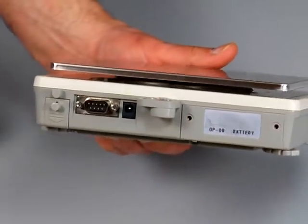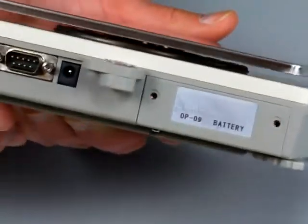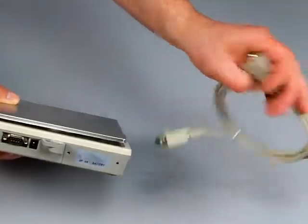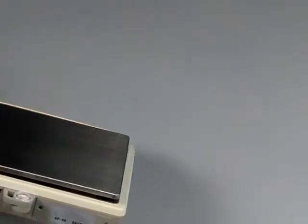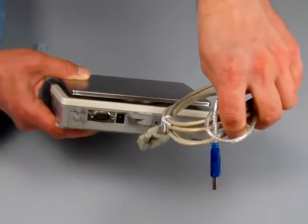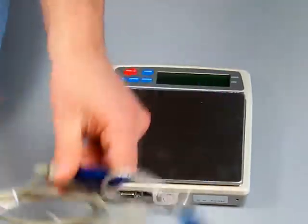On the back of the scale, you'll see a standard RS-232 interface. Other manufacturers charge for this module, and if you went with the EJ Series, you would have to pay for the RS-232 module — on this one, it comes standard. It does not come with the cable; we do sell the cables. It's a null-modem cable — female-female — and on the back of the scale we have a male port. You can also buy an RS-232 to USB adapter, daisy-chaining them together, which is a nice feature since many computers nowadays only come with a USB interface.